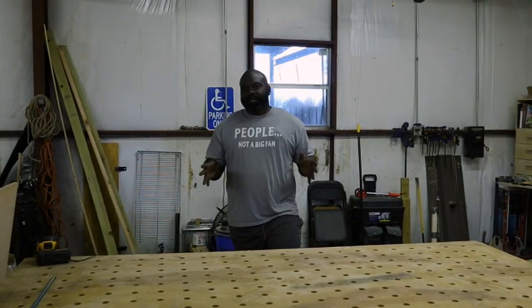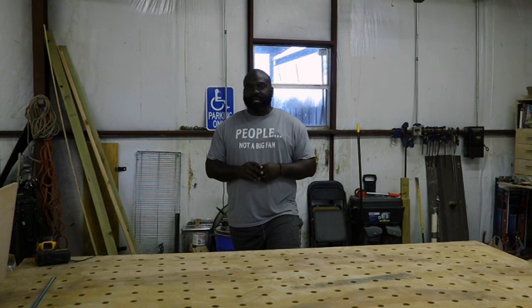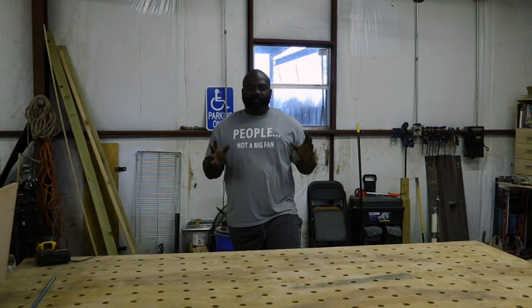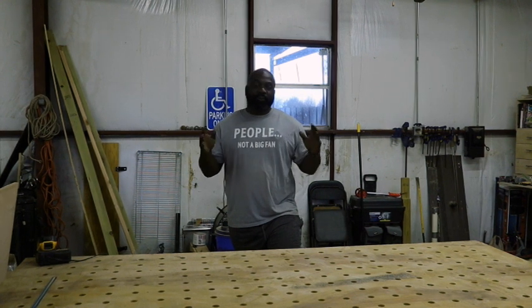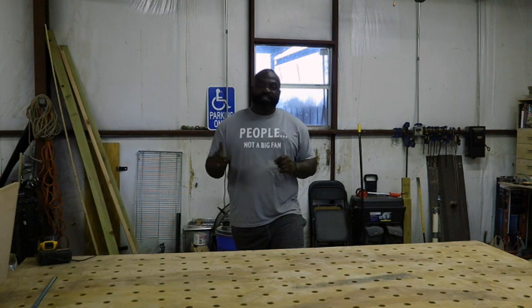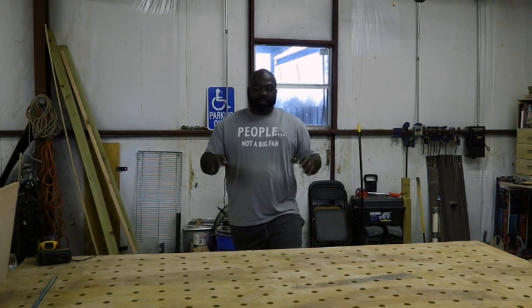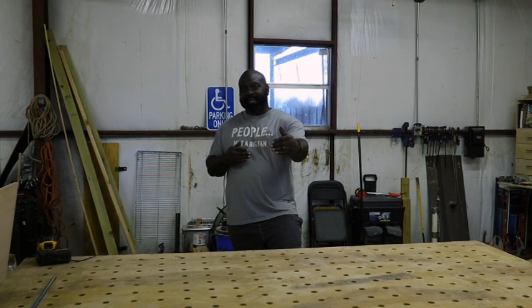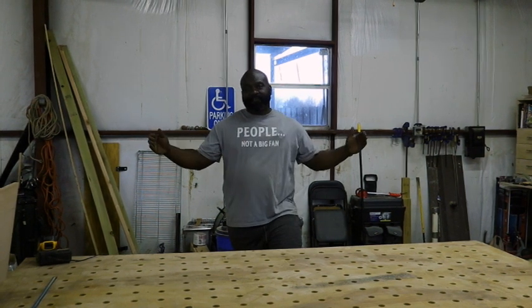We got this design from Brad from Fix This, Build That. We'll put the link to his channel down below, but he had a simple, easy plan where you just basically use 8 studs and 1 sheet of 3/4 inch plywood. So right now we're going to start off with the base, where it's going to be about 26.5 inches long and 6 feet wide.